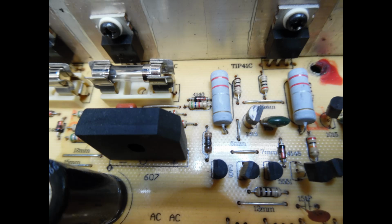But what it does have is, when you look at the board layout, on the top of the silk screen, they put the value of the component. So here the burnt out resistor, once you'd removed it, you would see 220. So it indicates to you that it's a 220 ohm resistor that has gone open circuit or burnt out. And that's the same for all of the components. The small signal transistors and capacitors, if you remove them, have the part number written on the board.